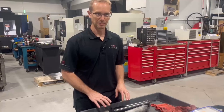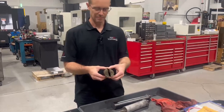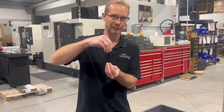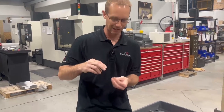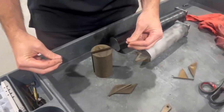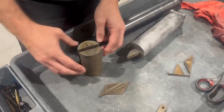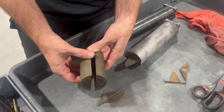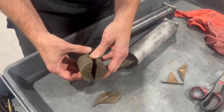The main problem with wiring this feature is the flush cups. Everybody who does wire EDM knows your goal is to sandwich those flush cups as close as you can to your part. We've got two main problems here: the heads are away from the part when we're flushing, and we're shooting flush onto the side of the wall, so it's literally shooting the flush away from the part. That's probably the biggest problem we have. So hopefully this extra-special high-end wire is going to do the trick. I really hope it'll cut a couple of hours out of the nine and a half. We'll let you know in just a few minutes.